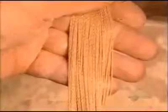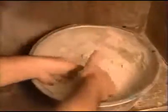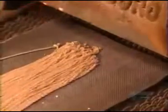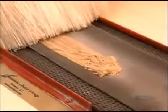They coat the finished chains with a lubricating powder that prevents the links from sticking to each other during the next step, when they heat the chains to 815 degrees Celsius. This activates a soldering agent added to the metals earlier. It fuses the ends of the links to each other.